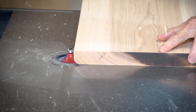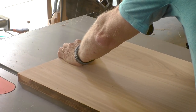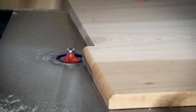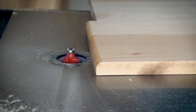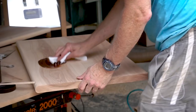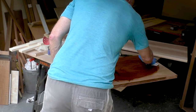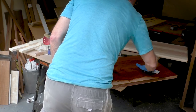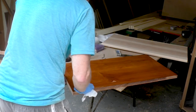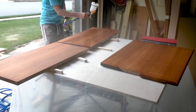I'm using a half-inch round over bit. I've got one inch of thickness, so with a half-inch round over I'll end up with a circular nose on the top. Now I'm applying the stain, just rubbing it in using a paper towel. Then, after letting that dry overnight, I'm spraying on some polyurethane with a satin finish.